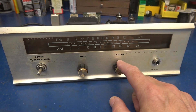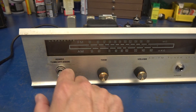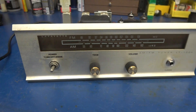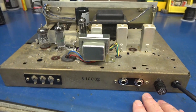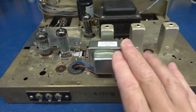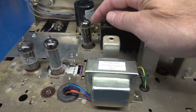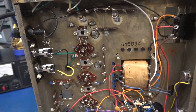This is input, volume, tone, and the power switch — center position off. This is the tube rectifier or diode rectifier selection. On the back side of the amp, speaker outputs are 4 and 8 ohm, coming off the CHAMP output transformer. The tube lineup: 12AX7 preamp, 6AQ5 output tube, and we reused the 6X4 rectifier. Here's the bottom side of the amp.